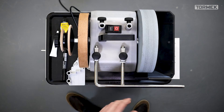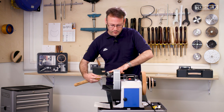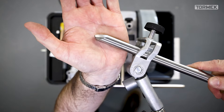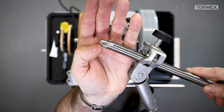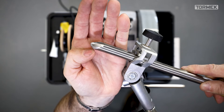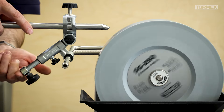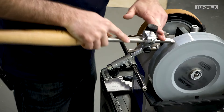Starting at the bottom, pushing down, quickly across the tip and then more time on the other side. Spending too much time on the tip flattens it off because it's a smaller area in contact with the stone. Looking at the result — a good clean crisp bevel all the way around and a second bevel as well. That second bevel gives clearance so you're not burying the heel into the curve of the bowl on concave cuts. To grind that away, just loosen the thumb screw, slide it forward, and focus on the heel.